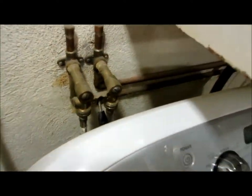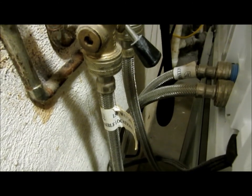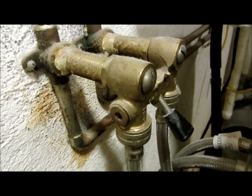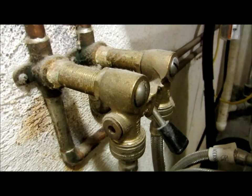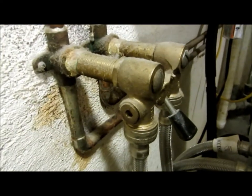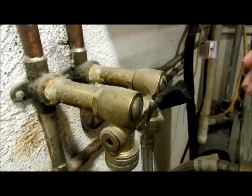What we have here is a Watts valve, and I've actually isolated the washing machine here and I put on these braided hoses. These braided hoses aren't bust-proof, however they're a lot stronger than the other ones — sort of bust-resistant is what I'd say. I suggest you spend the extra couple of bucks to get these instead of the other ones. Working over at the plumbing outfit, when we'd come back in on something that got flooded, it was because they went on vacation and didn't shut down the water to the washing machine and those cheap hoses broke — then you come in and your couch is floating down the hallway. But that's as simple as just turning that dude off right there. Now it's isolated; there's no way for anything to pop there.